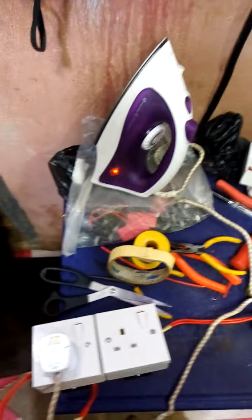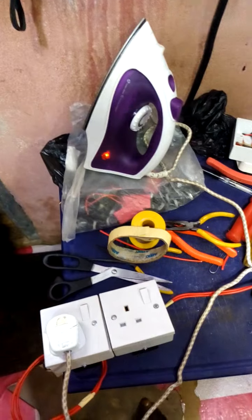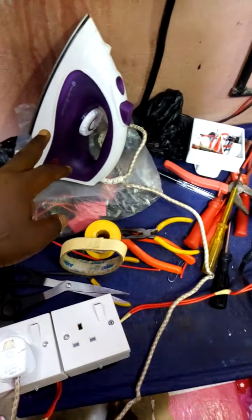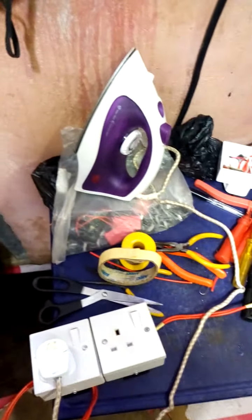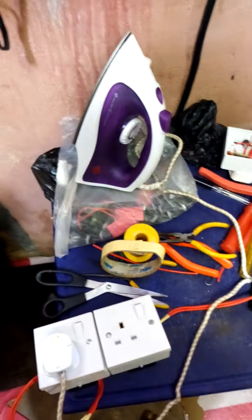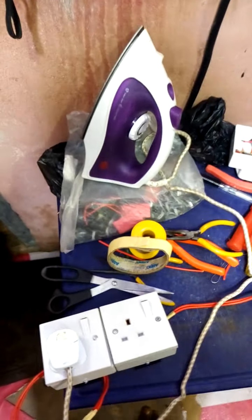For those using a generator, you can power all kinds of heating appliances. For pass-my-neighbor tiger generator owners, you can use a pressing iron of 1,200 watts — without steam or dry iron. You can use a bread toaster, a small ring boiler of 500 watts and 300 watts, and hot plates of 500 watts to 800 watts.